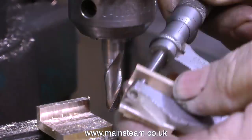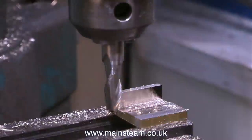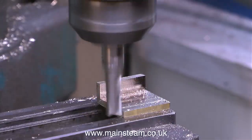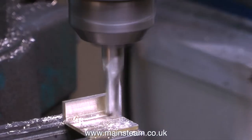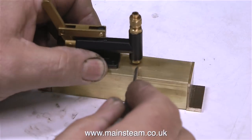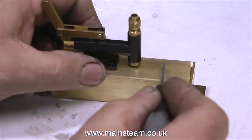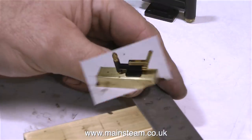And the reason for using a drill chuck like this is not just laziness, because I do have a Clarkson milling chuck as well, but I only have imperial collets for the milling chuck, and often the cutters that I buy are metric. As you can clearly see by this clip, I've milled one of the blocks into an angle to mount the tank. I'm now looking at the layout and where the pump's going to sit on top of the brass tank. And I know this is very crude marking out, but this is a prototype, so really, I'm just figuring it out as I go along.